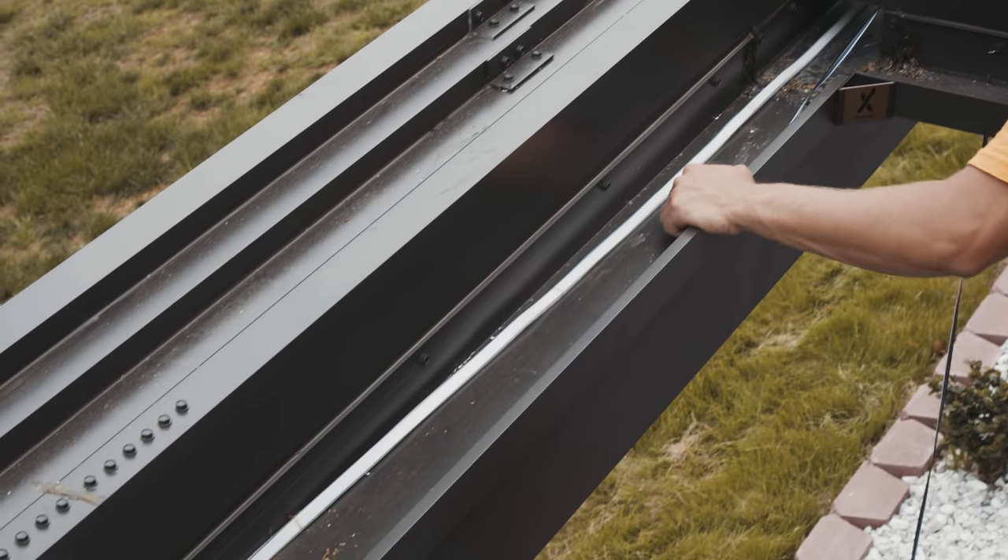This strip light is rated at 90 watts of load. If you take 90 watts divided by the working voltage, which is 24 volts DC, that gives you a rating of 3.75 amps. Please consult a wire load chart for which gauge wire you need. If you are uncomfortable with this, please consult a professional electrician, as they will know how to do this.